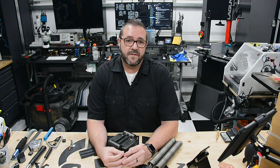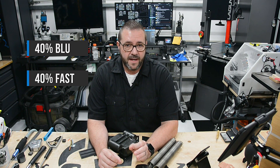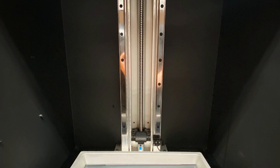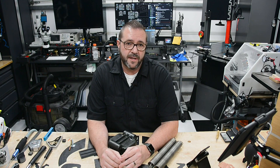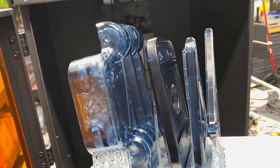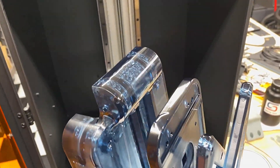The mixture I used for this project was based on the results of my recent resin mixing testing video. This new mixture is a lot tougher — the formulation is 40% blue, 40% fast, and 20% tenacious. As a rule of thumb on these larger printers, the tougher the resin the longer the cure time. The large bed of the Phenom has a high peel force — the force required to peel the part from the bed after it's cured — and tuning your layer times is critical. You'll want to be careful with cupping and thin supports for the best results and surface finish. After a couple of tuning test runs I printed my parts on the Phenom. Even though this printer is fast, the tough resin mixture took longer times to print than normal, and these parts are big. The base and carrier together took 48 hours to finish the print.